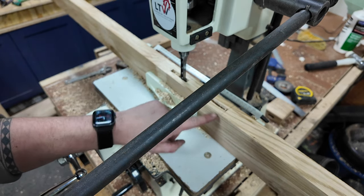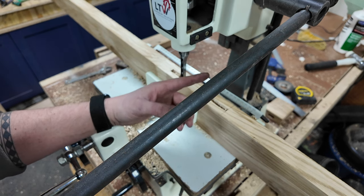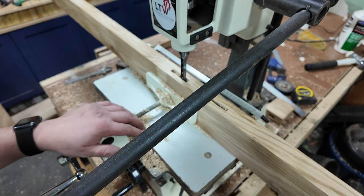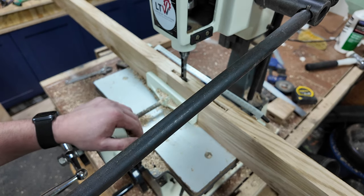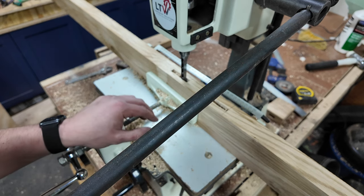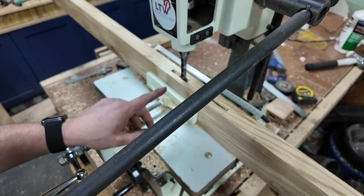I've already done the top rail because the top rail's still got the half inch chisel in it. I left the top rail as it is, just purely because it's a thicker rail, so it'll look proportionately right. Like I said, holding my hands up to some faults. Luckily this is my door and not a customer's, otherwise we might have to remake. But there you go. I'm going to get these all haunched out, and then we're on to rails.